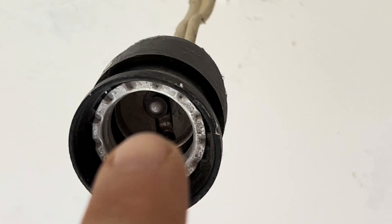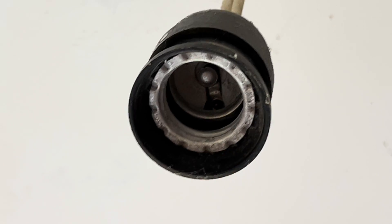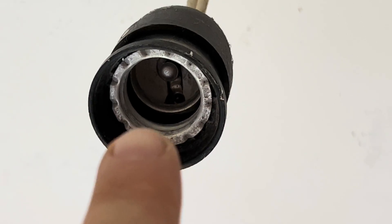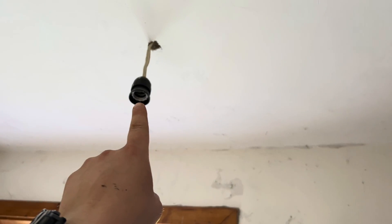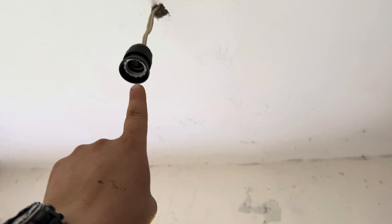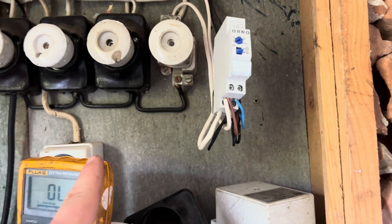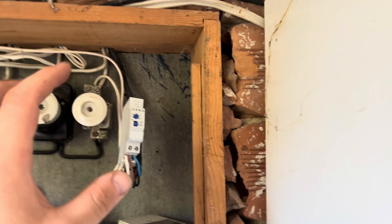In the middle of your bulb — you can see right there — this one is connected backwards, so the actual phase comes on the outside of the bulb, which is not right. The phase should be on the inside of the bulb. What I did is measure the resistance from the middle to each cable, and the one with the smallest resistance is the one to connect.